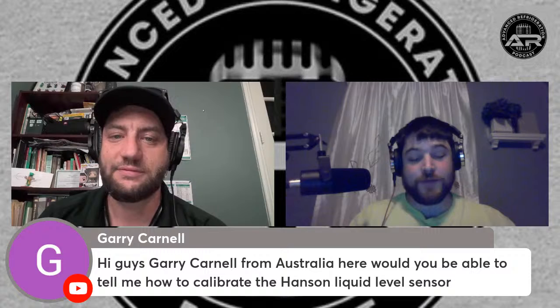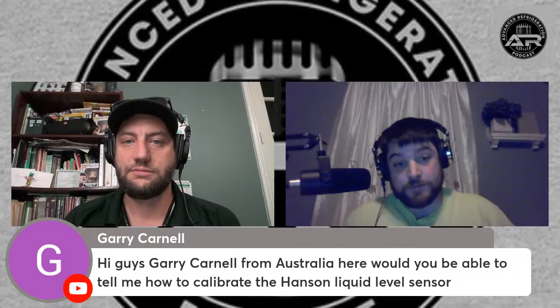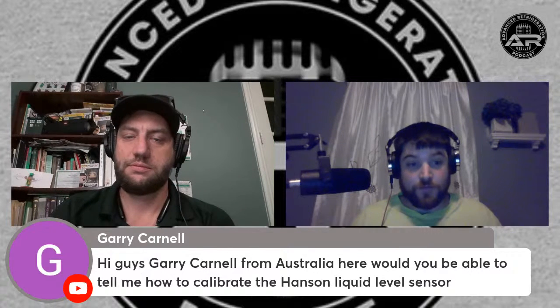Or you just throw a fat offset in there in the controller and say it fixes everything. Offset. Yeah, but I've seen the same thing with the wrong rod being in there. Sean, and don't put anything on the threads either. When you put the rod in the tank, you can't put Teflon tape on the threads. Why? It'll throw off the ground for the sensor.